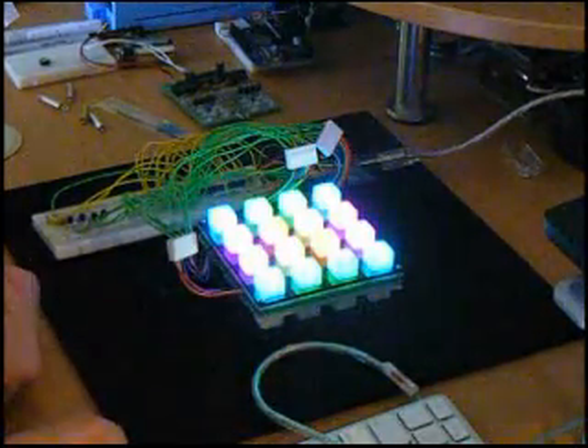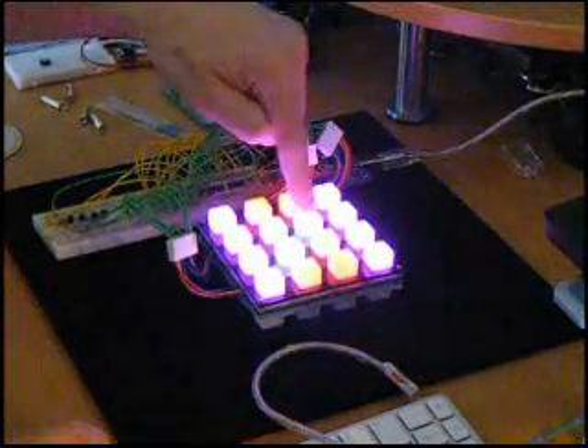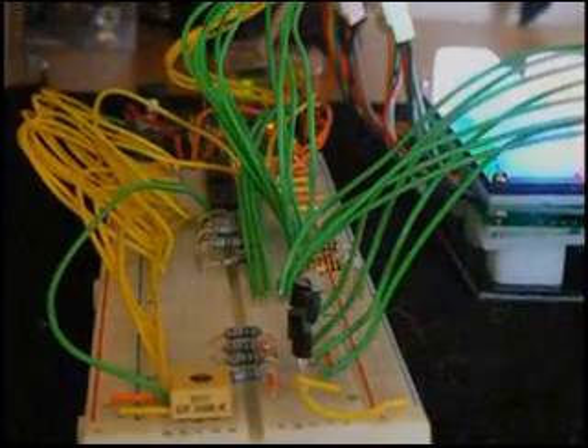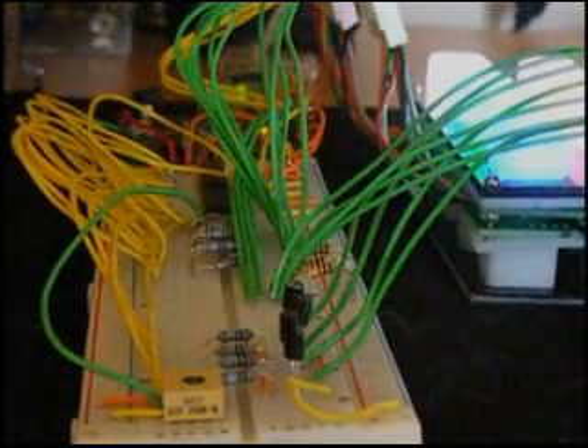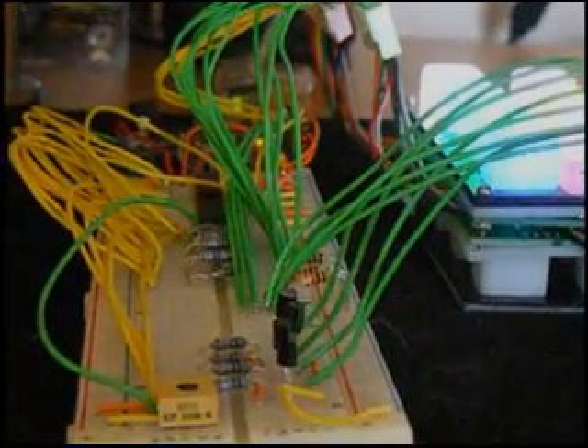The next step after this, I actually worked on a full color RGB button matrix. So far it's coming out really nice — a little rough around the edges, but I'll show you a little preview. You can see this breadboard's a little more complex, with two shift registers taking care of three colors, and four transistors for strobing each one of the rows. The rest of the inputs go right into the Arduino to figure out the button matrix logic.